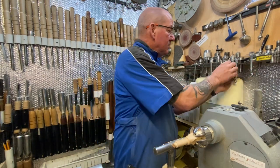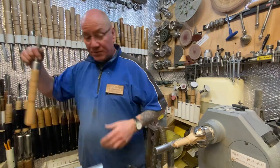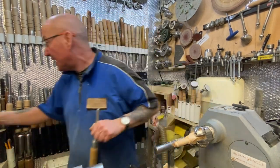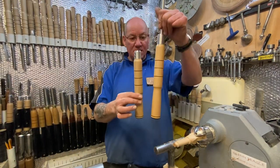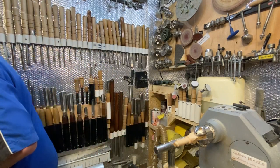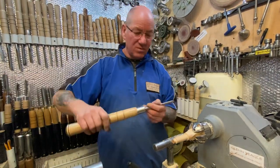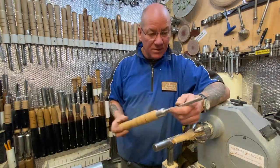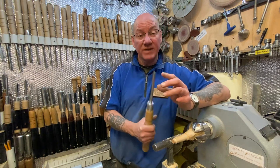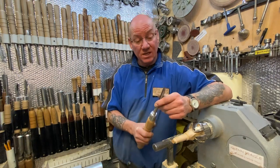So give it a place to live - there, that's your house, you stay there. Right, so there you go guys. Loving my spindle gouge - I've had another little sharpen of it. I did actually make up another handle because I wanted the tool bar to go further down, so I needed a slightly longer one. I changed the handle - I'd originally done the other one to go with my bowl gouges for shallow work. Just be aware guys when you buy it: tool shops on the packaging don't tell you that you're going to need to sharpen it before you can use it, which is really bad for new turners.